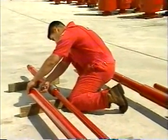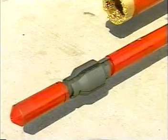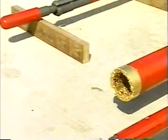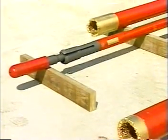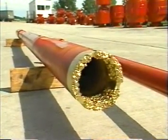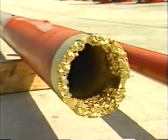Removal of permanent packers from the well also calls for unique fishing tools and techniques. Several different types of packer retrievers are used, depending on packer type and packer accessories used during completion. A proven method to retrieve a permanent packer in one trip enlists the use of a packer retriever assembly.